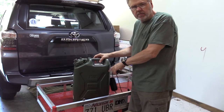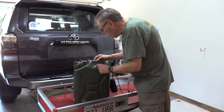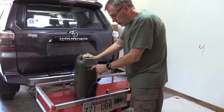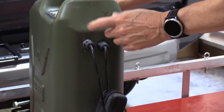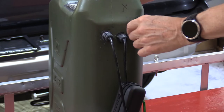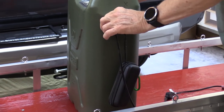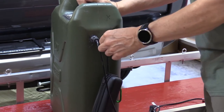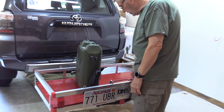I put a patch on that and used Flex Seal to seal it off. I took a piece of aluminum, used Flex Seal, and if you let it cure it works very well. It also leaked here on these connectors — expensive as these things were, they should work but they didn't. The problem was this material is so thick, like a quarter inch, you can't get a good tight connection. So for the connectors that go through and hold it to the tank, I used JB Weld to weld those in, then used Flex Seal on the wires, pulled the wires through, and tightened the outside nut. Now the thing is sealed for good and it doesn't leak anymore — it leaked like a sieve before. That's my two big updates.